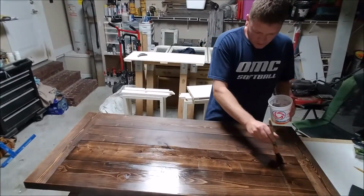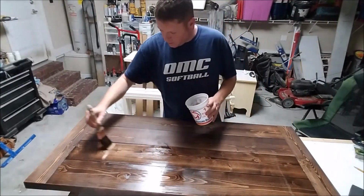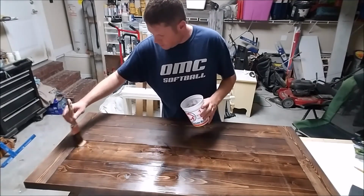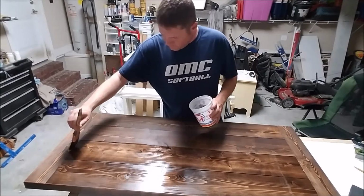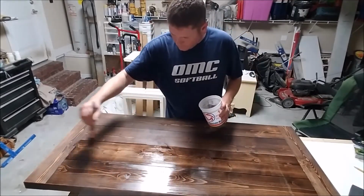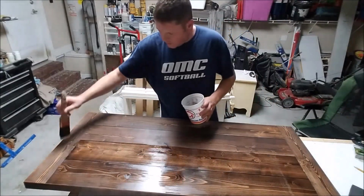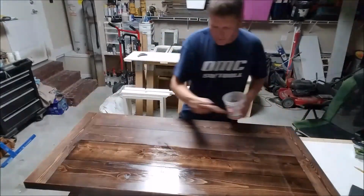But when you're doing a coffee table, get your top done kind of early because it's going to take 3 days to get it polyurethaned and dried. And you don't want to have to deliver something that's still wet. That's annoying.